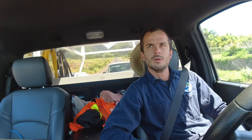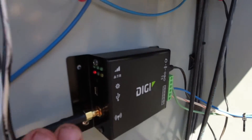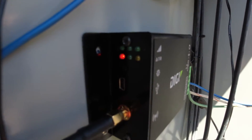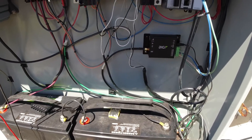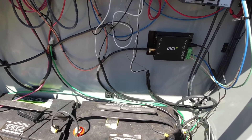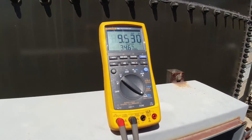Alright, we'll see you there. We've got our steady blinking red light, which is a good sign, and every time it transmits we get three full bars of radio strength. It's set to transmit once a minute. Our SCADA guy is seeing five feet in the tank. We're going to test the transducer and see what it's putting into the system, and then I'm also going to generate a signal into the system and see if he can see the generated value. We've got our Fluke 789 hooked up.